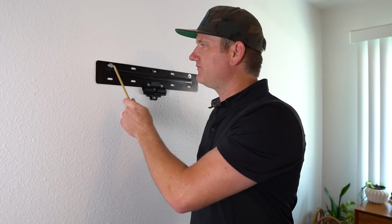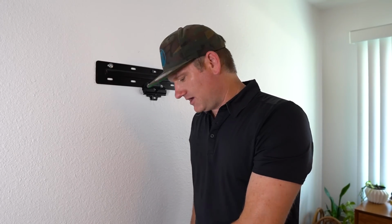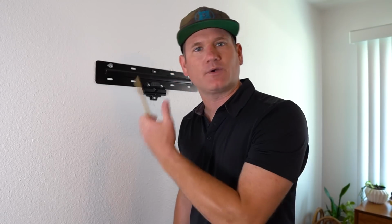This wall, as you saw before, had insulation pop out of that hole, so I know it's got insulation. Hopefully there's no fire block. If there's a fire block going across horizontally, that's a horizontal stud, and you may have to make other arrangements. We're going to find out what's going on in the wall. We're going to open a hole here, and then we're going to open a hole at the bottom, and then we're going to run that One Connect, and then we'll get to that cool customizable frame.